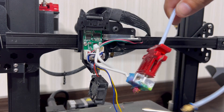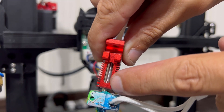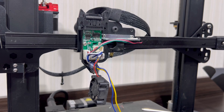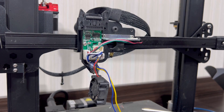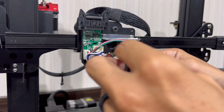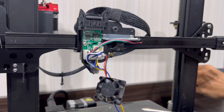Our old hot end is completely disconnected. Again, those two screws connecting the nozzle, throat, and bowden — you want to size it up and make sure the distance is consistent over time. These tube ends will warp if you print a lot, so you'll have to trim it. I cut my tubing a little longer than needed because at higher temperatures it's just wear and tear — same as changing tires on a car. Now I'm going to start putting the new hot end on. I'll unplug the hot end fan; it has a bead of glue on the bottom, so loosen that and pull it off.